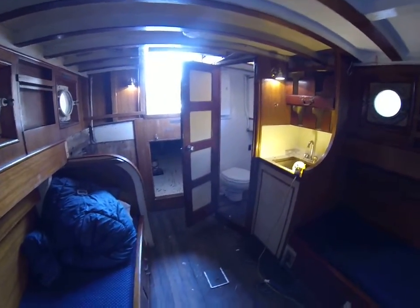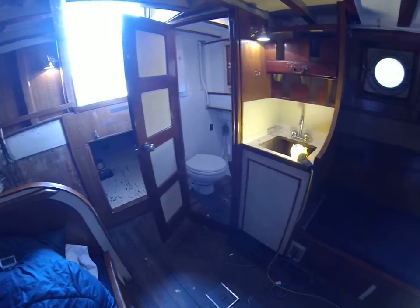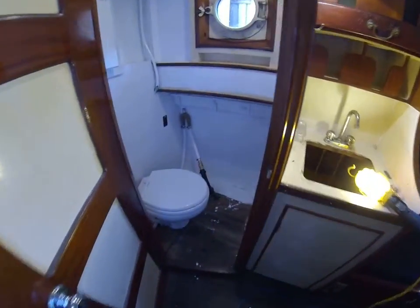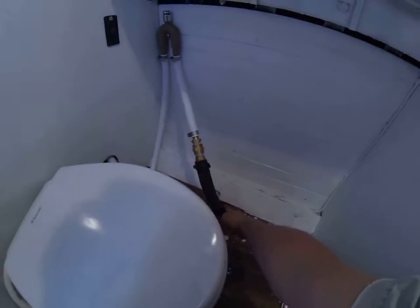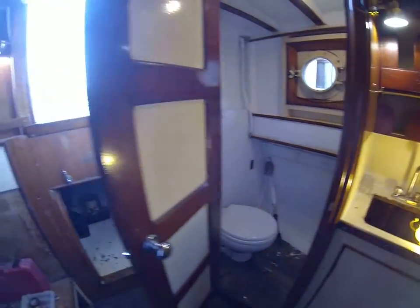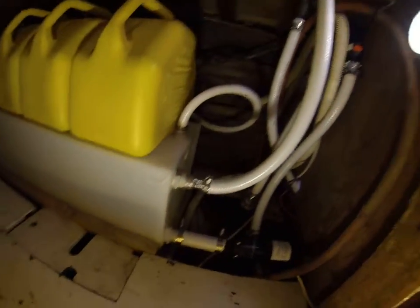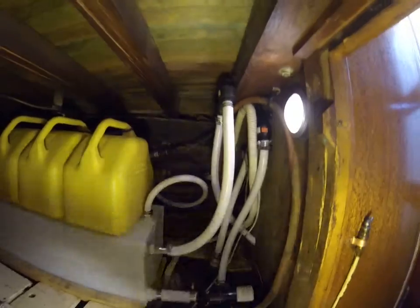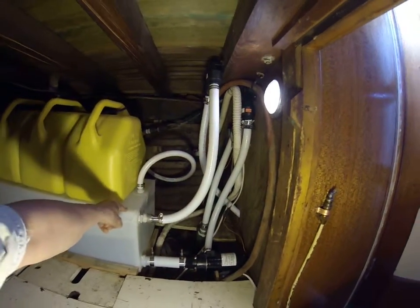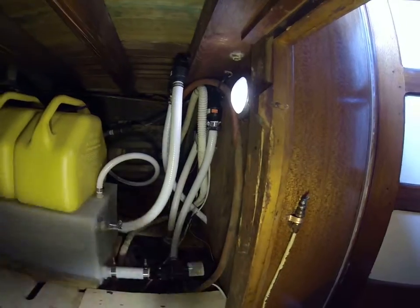We're on the older two. I've just installed a holding tank and electric flush toilet, although I haven't bolted the toilet down yet. I've run the intake through a hole through here - it comes up into the toilet - and the flushing is done through this. The exhaust goes to the back to the holding tank. The idea is you flush the toilet and it always goes into the holding tank, and then when you're out in deep water it gets macerated a second time as it gets exhausted out to the outside.